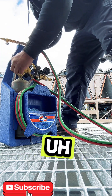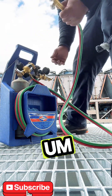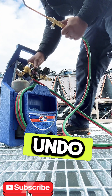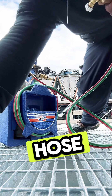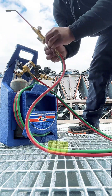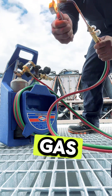So right now, what you want to do is there's a keyway on the back side of the acetylene tank on the left-hand side. It comes with a key. You can actually undo that service valve and it allows gas to flow through the red hose. On the right-hand side is the oxygen — there's a green hose. You want to open that knob up too, and it allows flow for both. That's your red side — open that up first. That's your acetylene gas.